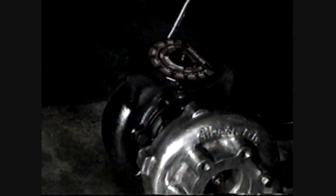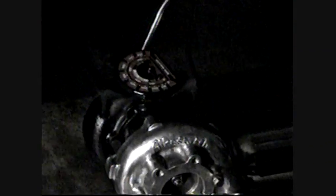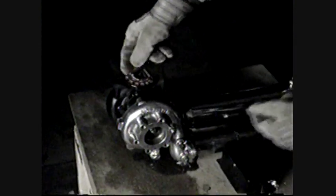What we've got here is my jet engine. It makes a lot of noise and uses a lot of fuel. What happens is you get this turbine spinning and then it pumps air in here where it mixes with propane, and then this spark plug ignites it and it burns and expands, which spins this turbine, which makes this one spin even faster, which pumps in more air, which burns and expands and makes this one spin faster, which makes this spin faster, which pumps in even more air, and it just keeps going and going like that.